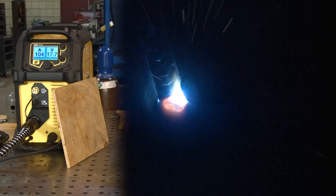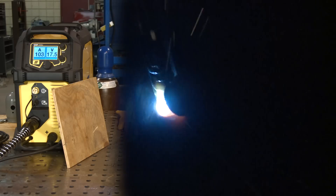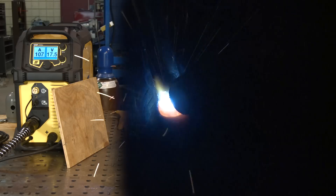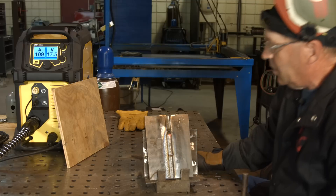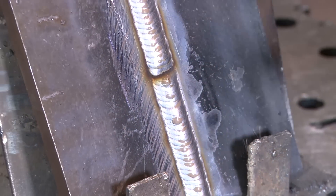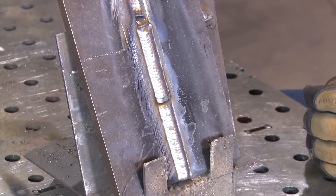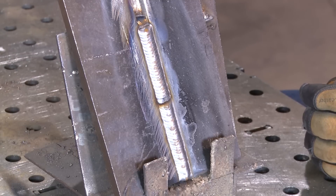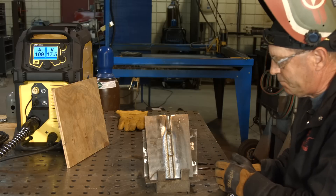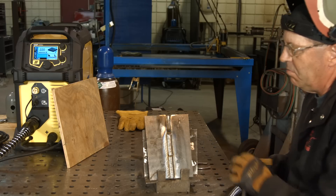I like this wire setting better for what we're doing. I am a little too full, but I'm looking at arc features more than anything. I like the way that laid down better — it's got more of a gentle rolling crown to it. This is probably still okay, although it's tending to look a little high, possibly pushing the eighth-inch tolerance. I'm pulling the trigger here; I've never run this S-MIG or this machine on MIG before. We ran it on stick a while ago and I was highly impressed, and just for what I've seen so far on this S-MIG program, I'm highly impressed.